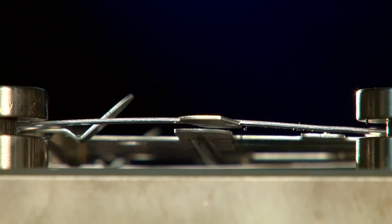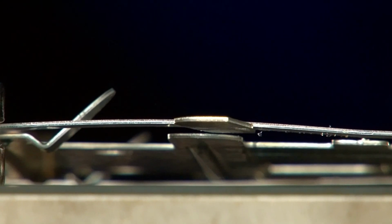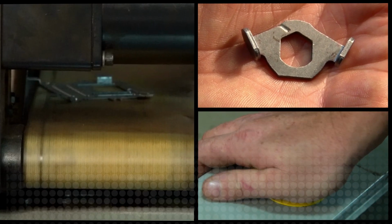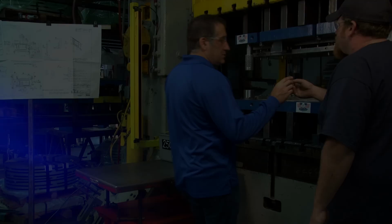When the slug is not retained in the stamping process, they can pull back up onto the surface and cause damaged or broken die details, costing thousands of dollars, lost productivity, rejected parts, and even the loss of valuable customers.